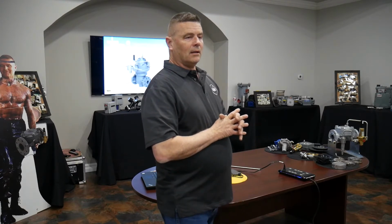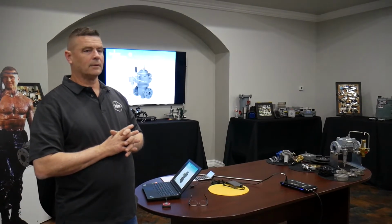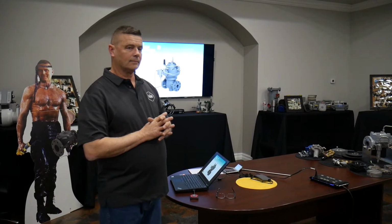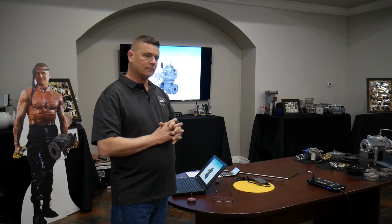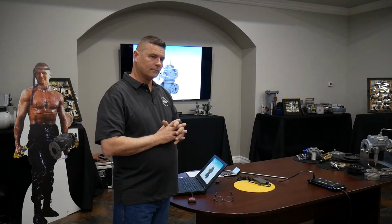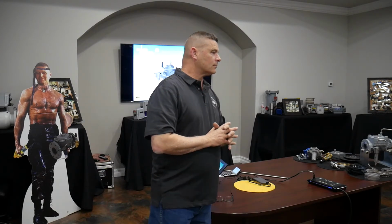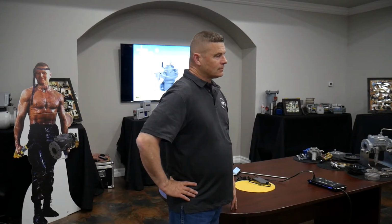To add to why you could sell this, the capacity itself is a lot higher than those flow grids in certain situations. Like in Oklahoma, a lot of times I'm in that ANSI 150 or below class. I can only sell two 2-inch regulators and a worker monitor, and we'll put a Flowmax on the relief. A 3-inch Flowmax, where you'd want to do a 4-inch flow grid or something like that. You can save money and get them the capacity they need. Well, I think the first quote we did on that was a paper mill, I believe. It was high volumes coming into this facility that's using lots of gas, but it had to be a very specific pressure coming into their equipment, and so in those high volumes.